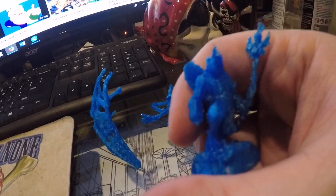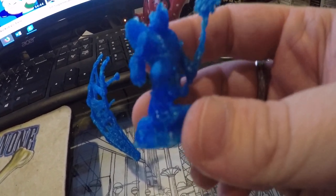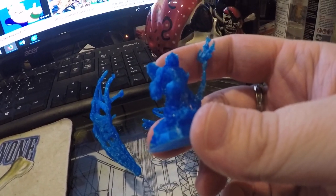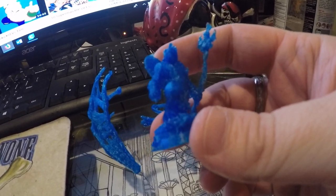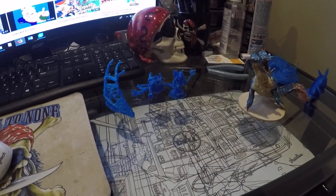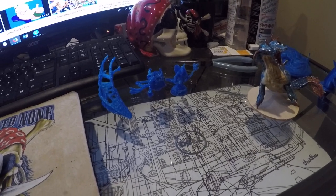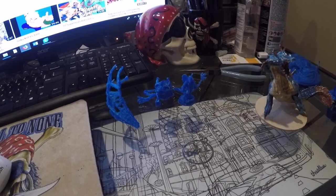For those that don't know what I'm working with here, this is PETG. I did operate under a false assumption that PETG was supposed to be temperatures of like 215 to 230. I don't know where I got those numbers — I was definitely wrong. So anyone working with PETG, it's 235 to 265. Currently I'm printing at 250, which this printer can do easily, and it reaches I think 265 or 280.